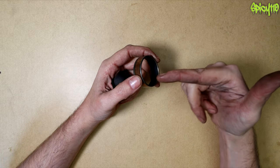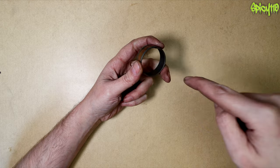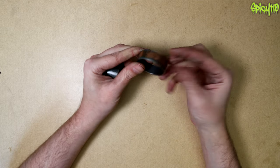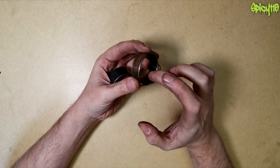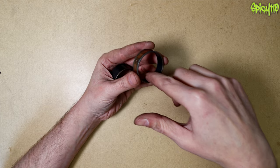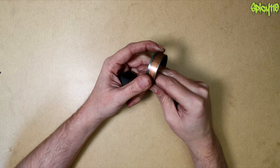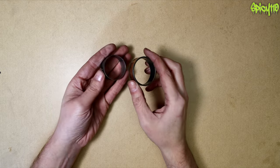A bushing is when you drill that hole bigger and put something in between, so the rod goes through the middle and you've got a wearing surface that can be replaced. Bushes are bearings because they are a bearing surface. They have a very hard, smooth and slippery coating inside which can also take oil well, giving it a film of oil. They guide tubes — like fork tubes — up and down.